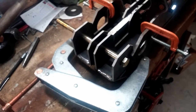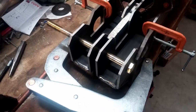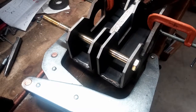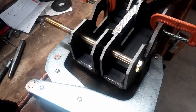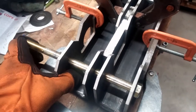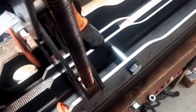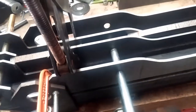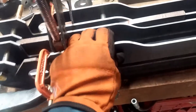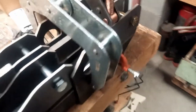Now to make sure that it is not only square but is not binding anywhere — that things really do align — the holes for these bolts are drilled right on size. After it's all assembled, these bolts do still move, every one of them. Just a little bit, so we know that they really are right on size and everything is aligned just about as perfect as possible.